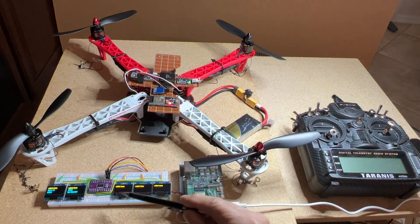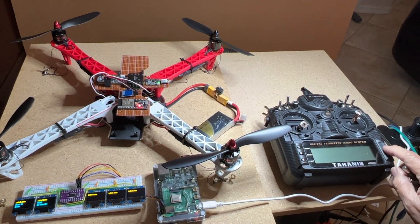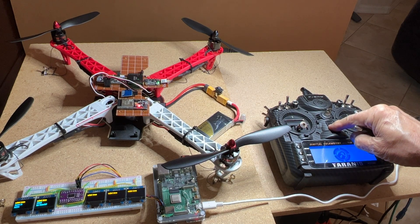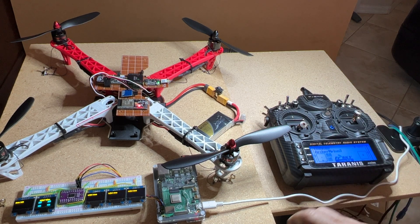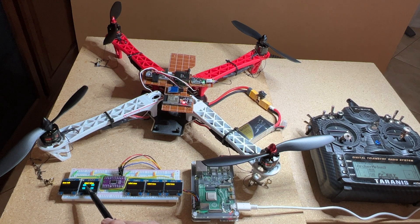At the BEC connection, there is a white signal wire that the STM32F411 uses to communicate to the ESCs to control the speeds of the motors. The client is connected, but there is no data coming from the transmitter as it has not been turned on yet. Turning on the transmitter puts the drone into what I call drone mode if the S1 and S2 knobs are turned all the way counterclockwise. I use the S1 and S2 knobs to dial up different functions, such as a motor test to test each motor, and sensor checks on the BNO055.